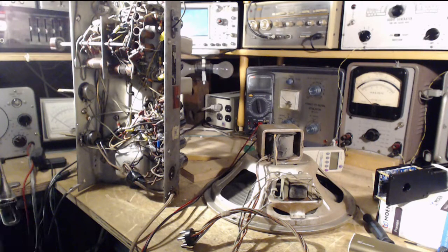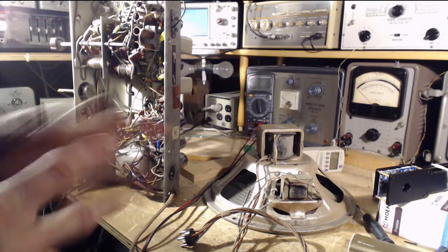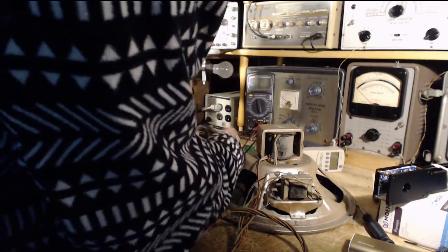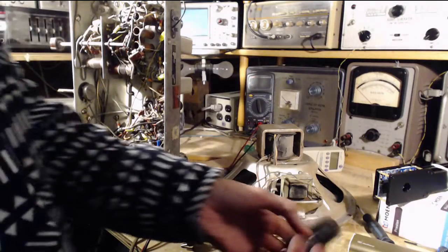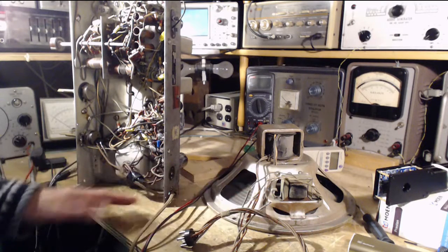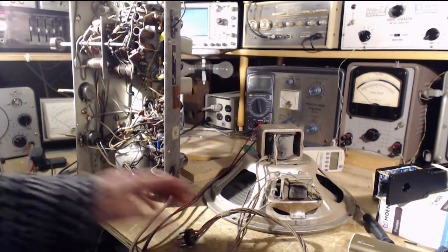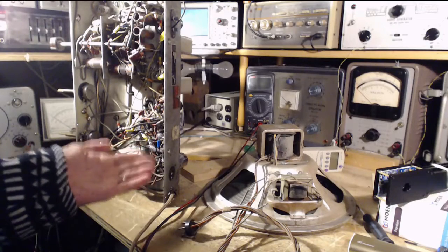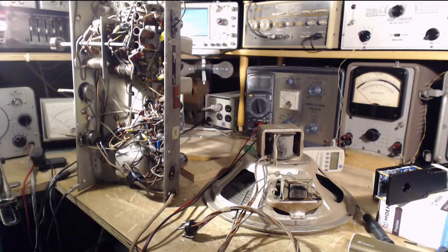So, if you're watching the video series, you know the jackpot situation I'm in right now with what appears to be a defective output transformer on the speaker. I was just saying to myself before turning on the cameras, I can just carry on, do the alignment, and take out the two output tubes here. Then there's no problem with imbalanced operation of one output tube, because there's no plate voltage on the other, etc. Then I thought, well, I'll just take the speaker and put it away somewhere, and then I realized I can't operate this set without the field coil plugged in.